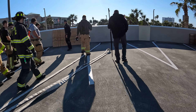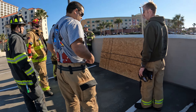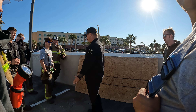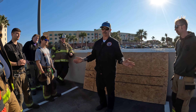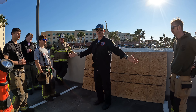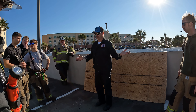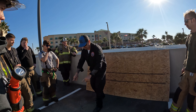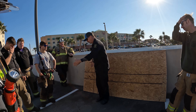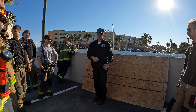Here's the scenario: apartment complex, all apartment doors, a sidewalk, bushes, and cars — sound familiar? I may not be able to do a forward stretch between the cars; bushes may be in the way. If you have to operate in that narrow corridor, you can do a split stretch: take those two big ears, one goes this way and one goes that way — two equal lengths. Anybody familiar with a triple split? It's the same concept — you use lateral space when you split it. The three primary ways to stretch are: forward stretch, back stretch, and split stretch. The split stretch is really only used when working on balconies or walkways where obstructions prevent one of the other two.